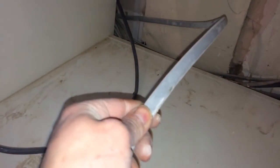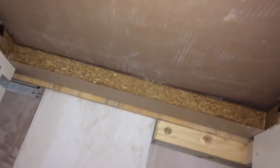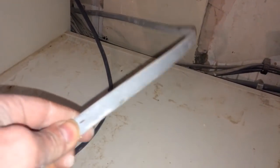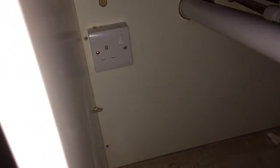Down here I'm going to fit a box for this hob. The hob's wiring is 6mm and it will go in this gap up here. And this is then the oven - 2.5mm for the oven which goes on a flex outlet plate. And this goes on a 45 amp flex outlet plate just for the loading. And then here you're going to have an integrated dishwasher so all you do is fit your socket in there and they can just loop the plug over the top through a hole.